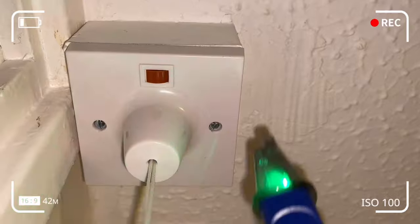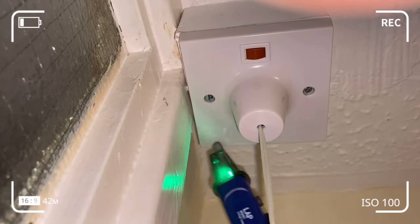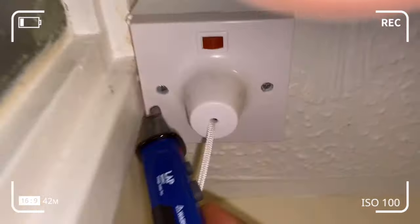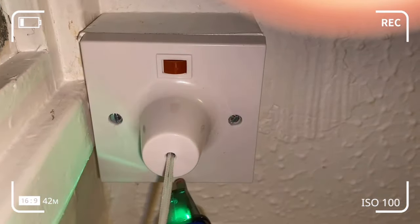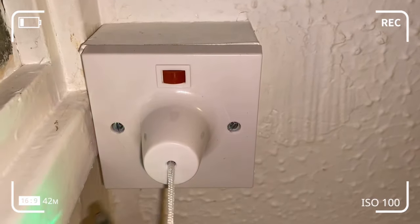Note how I'm testing — I'm not actually touching the tip of the pen, because that could lead to electrocution. Because the pen is quite sensitive, I'm not establishing contact between the pen and the wires. I'm just testing from a considerable distance, because it's quite sensitive — if you take it too close it's going to pick up on everything.